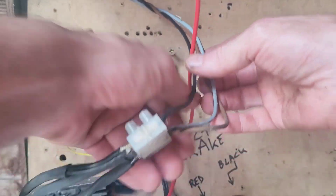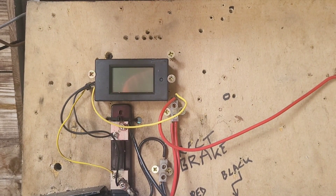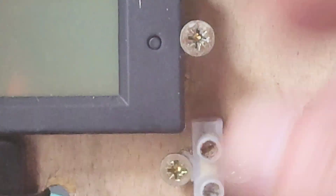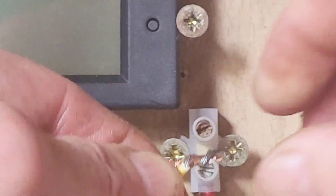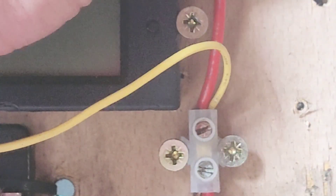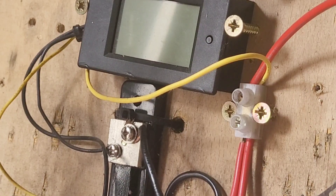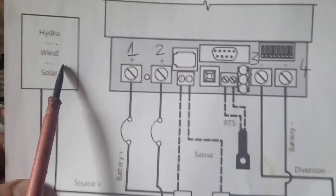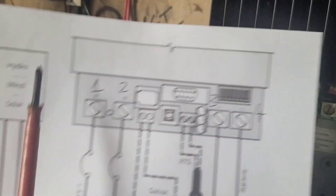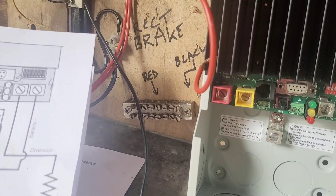We can maybe move these cables out of the way a bit. I had noticed there's a connection here which is potentially loose so I'm just going to tighten that up. Check these connections here — that one looks okay, that one looks good. Right, it does say in the manual we have to connect the batteries up first, which is from the two cables we just got. Those two have to go direct to the battery according to this, so let's do that first.